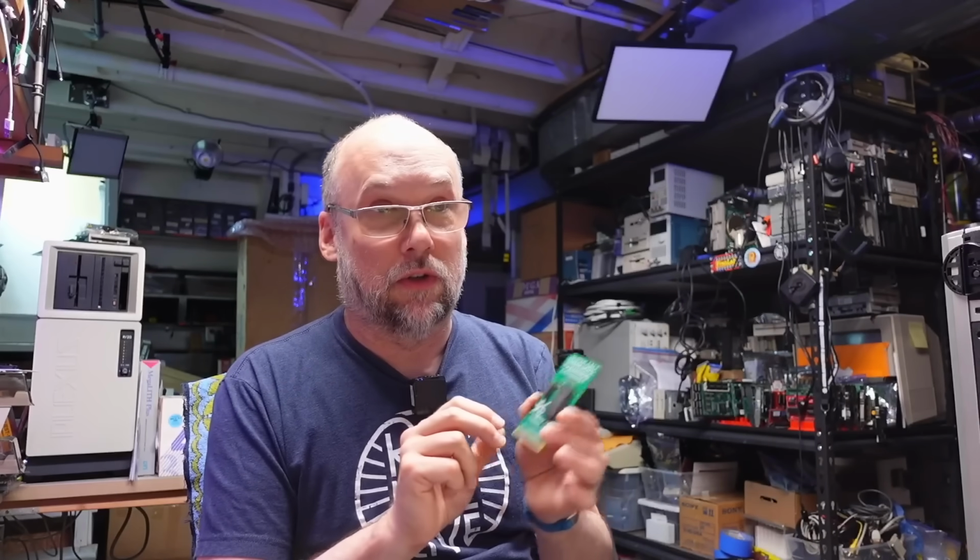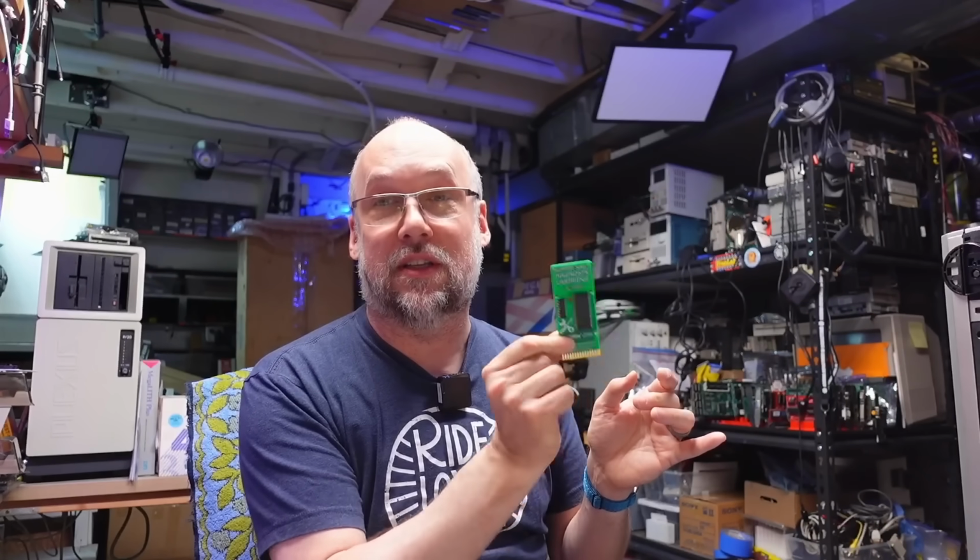I learned a lot about these machines, like what the minimum viable configuration is to get these things at least showing something on screen. And I found it interesting that the Super Salt cartridge, if I had actually found this right off the bat, might have told me right away what was actually wrong with this machine, which was bad RAM. Remember when we put this thing in, I think it said code or error 5. Not sure if that relates to which bit is bad on the RAM card, but that's actually possible. If you happen to be watching this and you know more about the diagnostic codes that this thing gives, definitely comment down below. But at least for me in the future, if I ever plug this in and get that yellow screen with just an error code, then I know I'm going to go look for the DRAM.